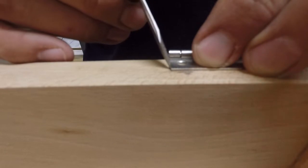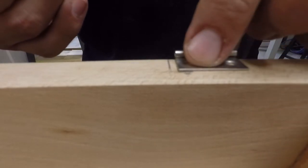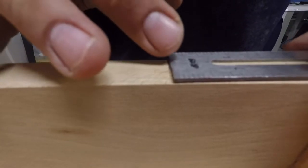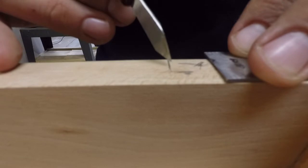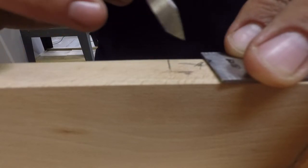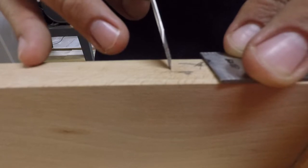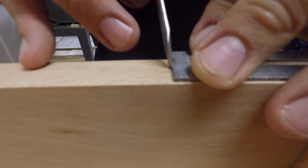Naturally you're going to want to - which is completely incorrect - put your hinge against the line you made and start using your knife to make your mark. I'm not digging into the wood right now; this is the incorrect way of doing it. You're risking the chance of the hinge moving on you and your lines not coming out straight. Use the marking tool, the measuring tool, whatever you used to make the line, so that it's nice and accurate. Start a sixteenth of an inch below that top line, move the marking gauge towards the knife, and cut your line.